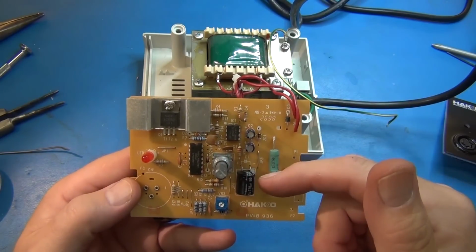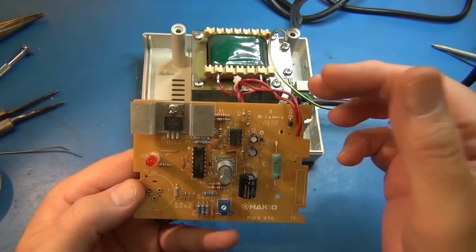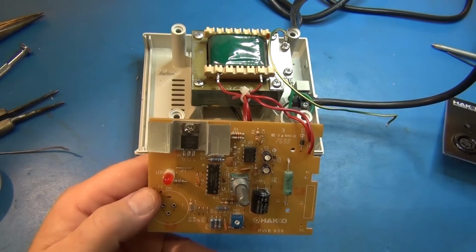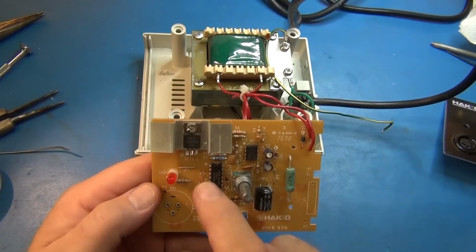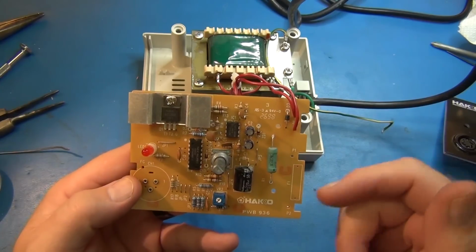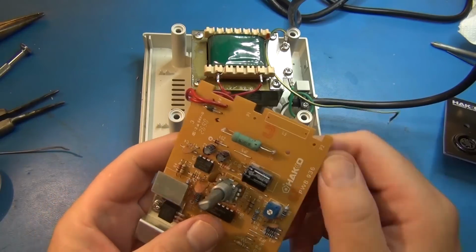This circuit over here is creating the plus and minus VCC to drive your op amps and your chips, but the 24 volts is used directly from this transformer through the Triac, AC wise, directly to the tip. And that will be the same in the CSI. There's nothing really complicated here. Very simple, very clean. It's been reliable. I've had this for, well, probably as long as the date code says.